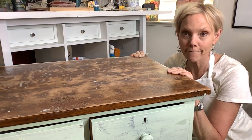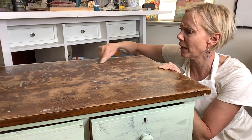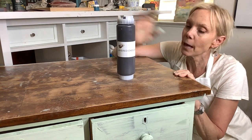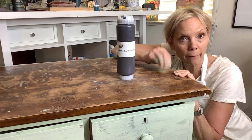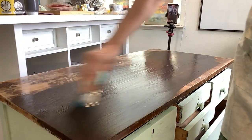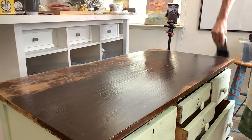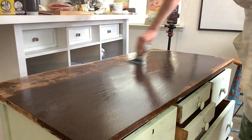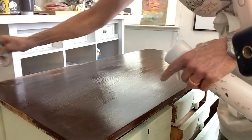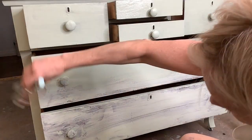The top is going to get a faux stain finish. The little gray dots are where I used the JB Weld compound to fix the deep scratches. I'm going to show you a trick: I use DIY Paint Layered Chocolate and do a couple of coats, then go over it with DIY Paint Dark and Decrepit all-natural stain — it will really mimic the look of hardwood and be hard to tell the difference. One of my favorite things about DIY Paint is not only that it's all natural, super durable, and easy to use, but there are literally endless color combinations and faux finishes you can make with it. Layered Chocolate is definitely one to keep in your toolbox.